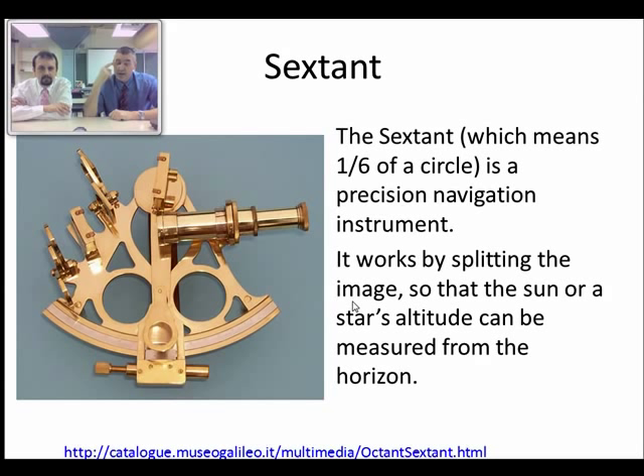There's a video from the Galileo Museum that shows how this works. There's a half mirror here, and when you look through this little viewfinder — it's a little mini telescope, actually — you can see simultaneously the horizon and some star. You can position it very precisely to line the image of the star up with the image of the horizon, and then very precisely measure that difference. The idea was if you were looking during the daytime at the sun, you would bring the sun down to the horizon, and once you got it there you could measure the angle, and that would tell you your location and time.